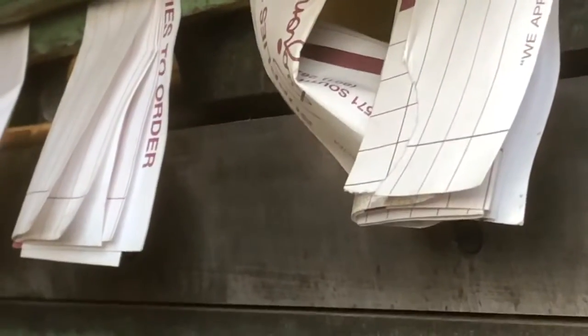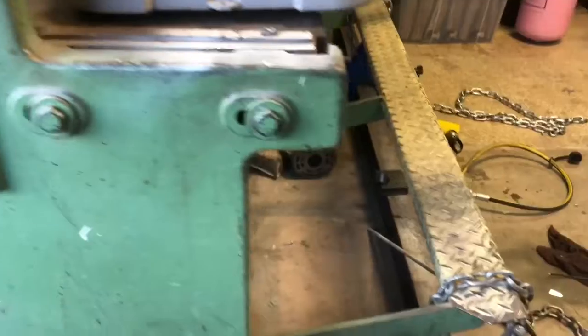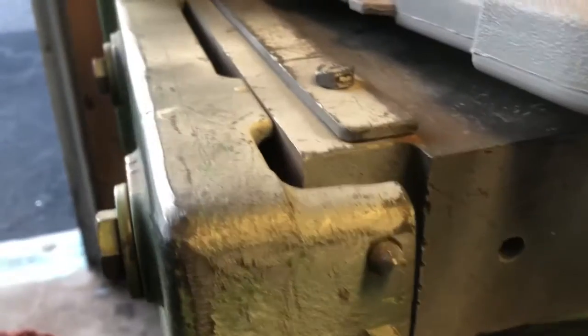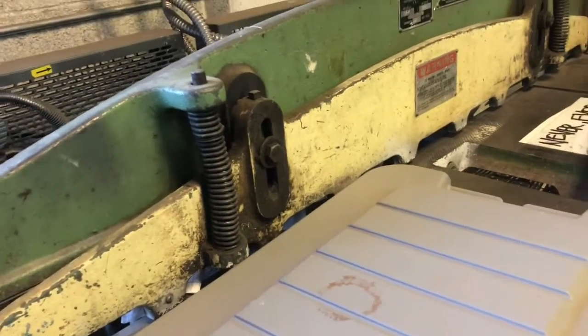is they had the blades sharpened on it and didn't quite know how to go about setting the depth of the blade, so they put a bunch of paper shims behind it. So anyway, we're smart enough to figure out, I guess, that you loosen those two nuts right there and you drive the table back with those two bolts right there to set your cut depth, or your blade clearance, excuse me. So anyway, I'm going to tear that part of it down, see if we can get it all dialed in, get it cutting like new, and go from there.